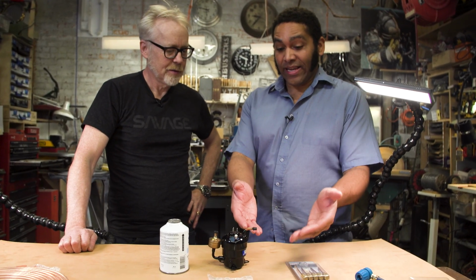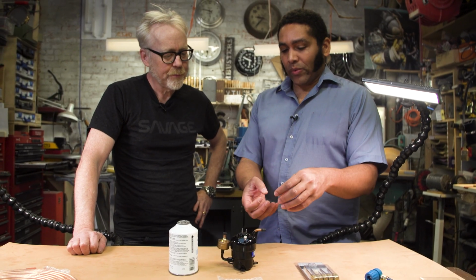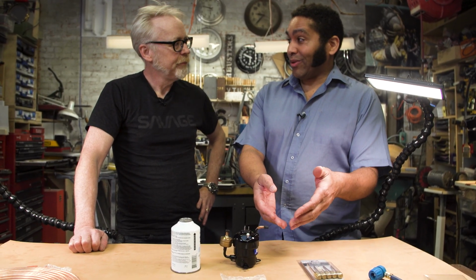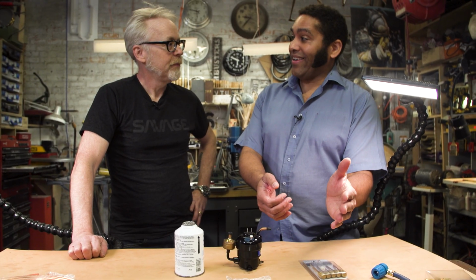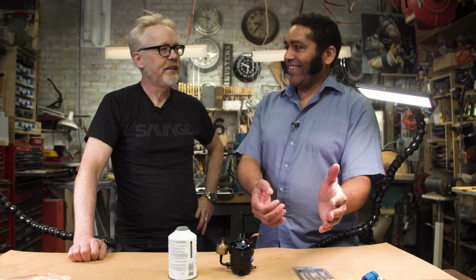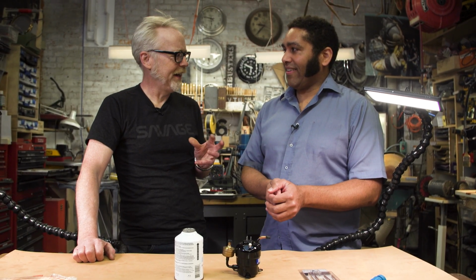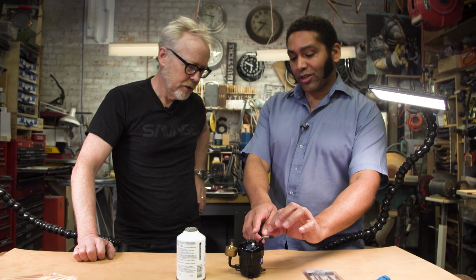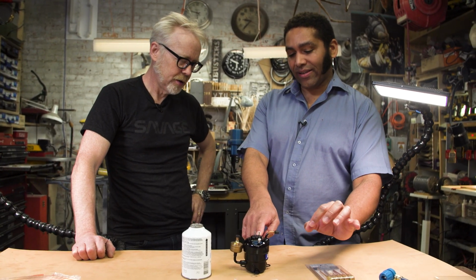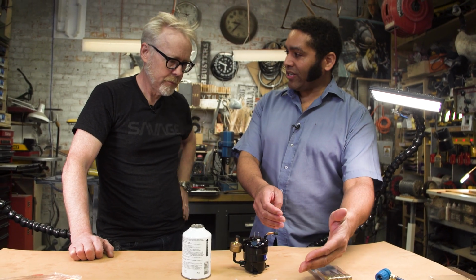So the gas gets hot as we do work to it and it gets compressed. We can push that hot gas through another heat exchanger where we blow air over it and take that heat away. And when we take the heat away, we're not just removing heat, we're actually compressing the gas as well? Or no, we're actually just removing the heat. Oh, okay. So the pressure from this output side stays constant. The temperature is what changes.